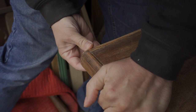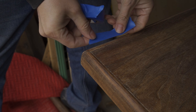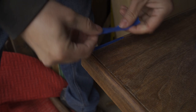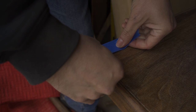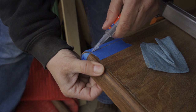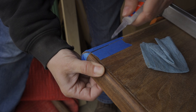I did have to make one small structural repair — this piece of trim was loose at the corner, so I just needed to glue that up. I used superglue instead of wood glue because I couldn't see inside the joint and didn't know if there was debris or dried glue that would prevent wood glue from sticking. Superglue sticks to most things. I taped off around it to avoid getting superglue anywhere I didn't want it.